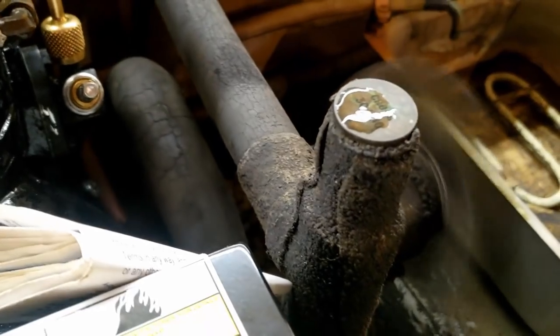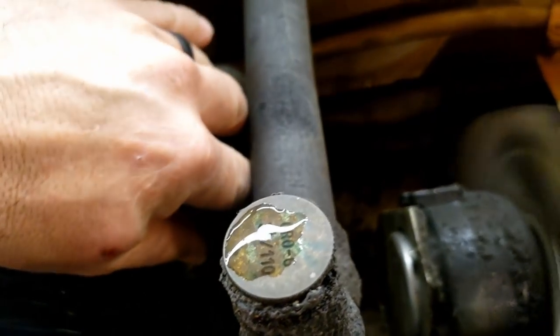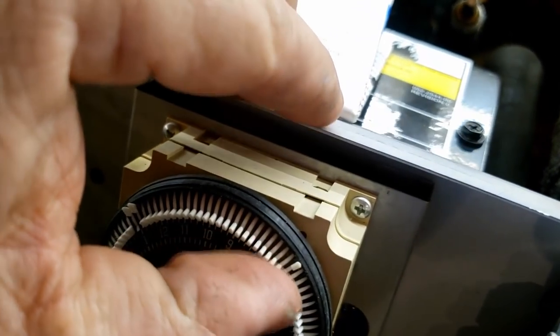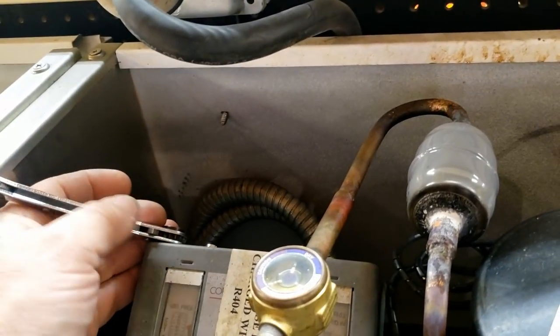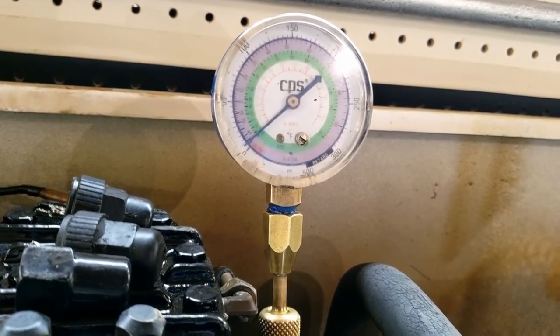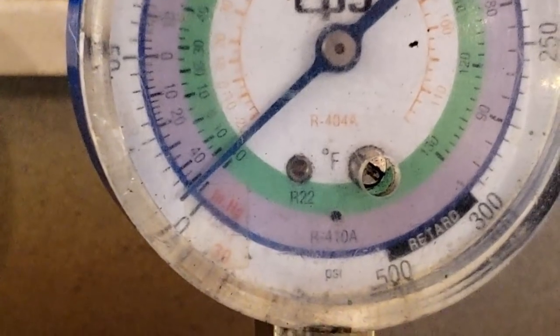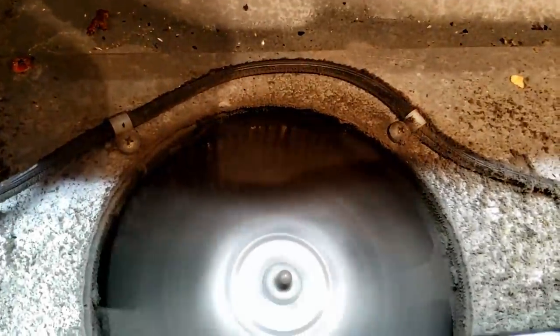Now with this having a CPR valve — which is interesting — there's a hellacious amount of shake on it. Let's pump her down one more time. What we might do is adjust that pressure switch — there, a little bit higher. Maybe that will help out. I don't think it's going to cause issues with it not staying off — you might get a little bit of pressure rise. Let's go ahead and get this coil thawed out because things are starting to look a little more normal. The coil is still frozen in there, and one fan blade seems to be banging on something.